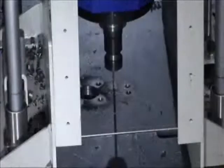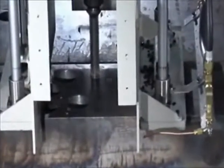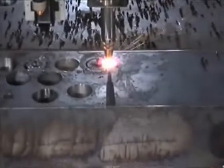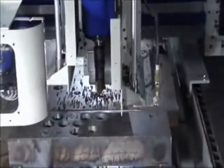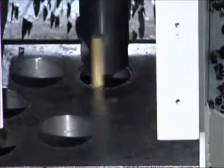With a 40-taper spindle and a variety of tools, you'll be able to drill and tap into material up to 4 inches thick and 2 inches in diameter in one pass. Large diameters are achievable with multiple-pass techniques.